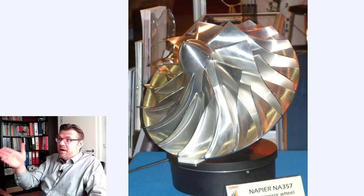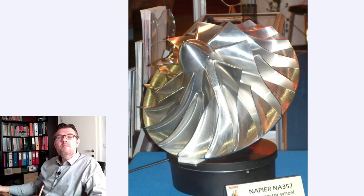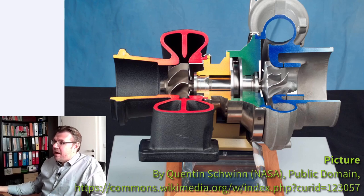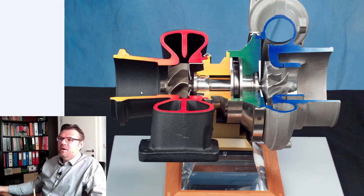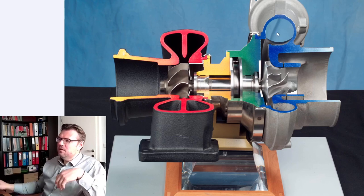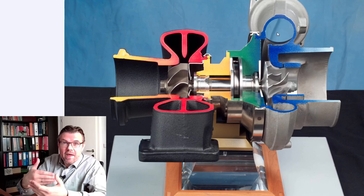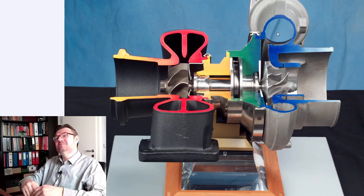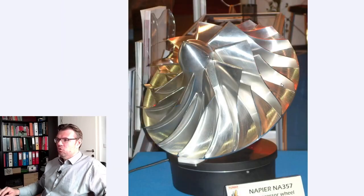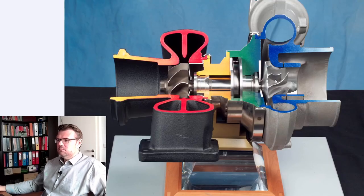Looks very complicated. Heavily in use. One typical application you see here, turbocharger. Here is the radial compressor. Suck in air here and move it out radially. This is the turbine from the exhaust gases, which will be spun up, and this is the compressor which will lead to charge. We need more air in the combustion area. So turbos are heavily in use in the automobile industry. Typical application. You see, here's the runner, and it looks like this one. Radial compressor.